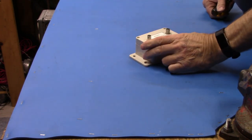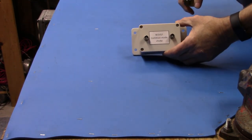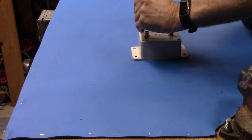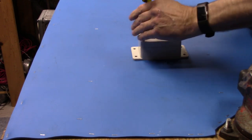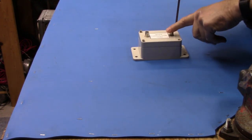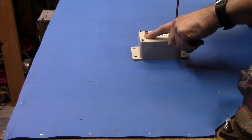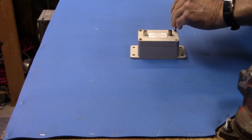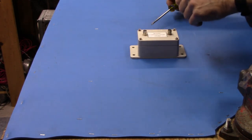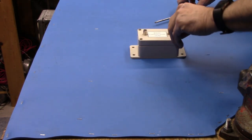Okay, we're back at the Group W bench. I'm going to take the cover off to give it a better look. I took some higher resolution pictures I'll put up on screen — you can pause and take a look. It's not very complex. I use a plastic box because both BNC connectors are mounted to the plastic. When you build one of these common mode chokes, you can't have the two BNCs grounded to each other — they have to be isolated. The reason is you want that inductance inside to be in series with the shield, not with the center conductor.